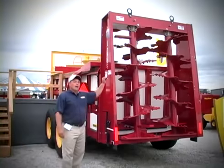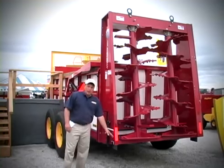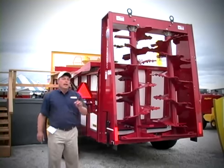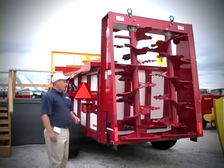The innovative top-down driven beater design doesn't require any lower gearbox, improving the ground clearance underneath the beater section. This allows for easier maneuvering in tight barnyards as well as added clearance when entering and exiting fields or when spreading across field swales.